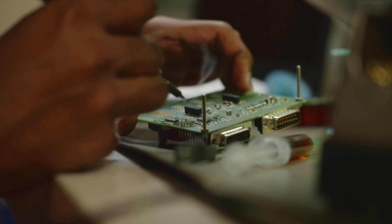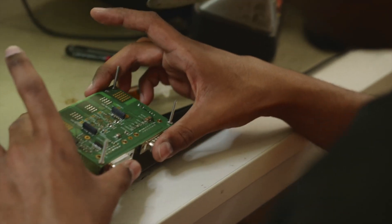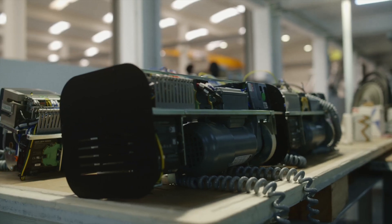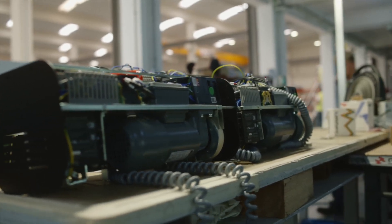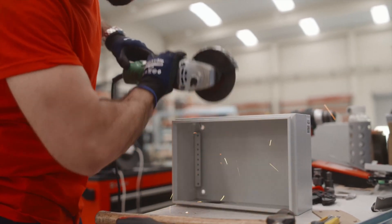Second, what makes this size trouble even worse? State-of-the-art sensor and servo drive electronics are so bulky that they result in a size addition that is often even larger than the motor itself. So besides needing a larger motor, as a machine engineer I will need to find extra space at the point of motion for that. Very constraining.